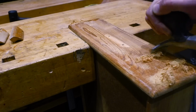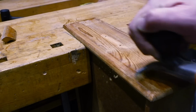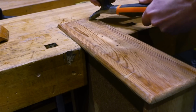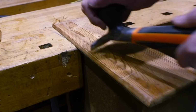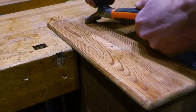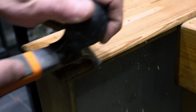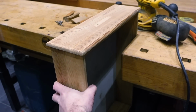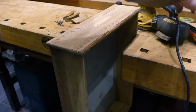So the desk had some old lacquer finish to it. So I used a scraper to remove it and then later on I sanded it a bit. But it was pretty easy to remove the old lacquer. I mean, it's an old table. I have never experienced any pine veneer, so I guess this is solid wood. So there's no risk to ruin it by the sanding.